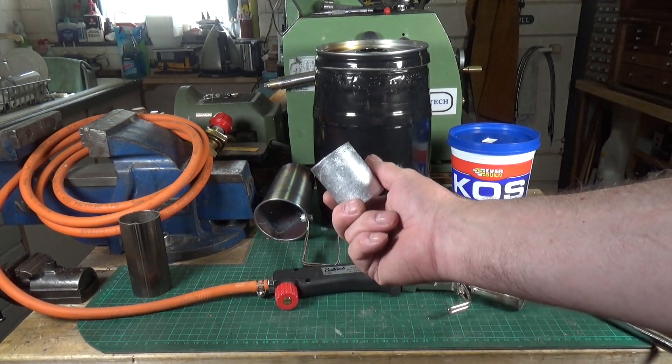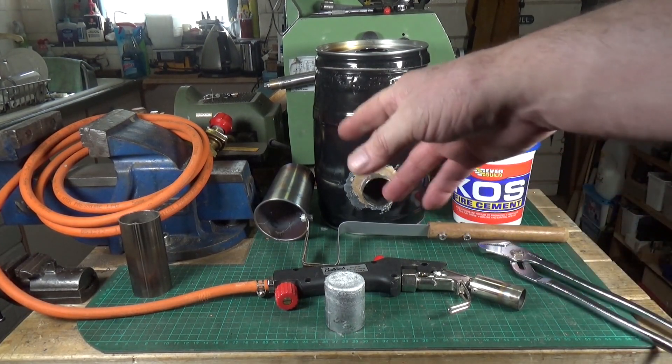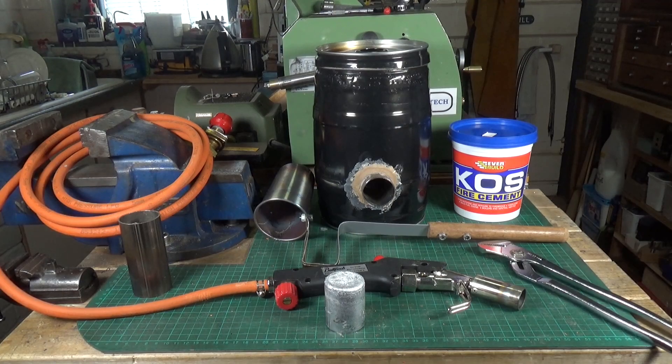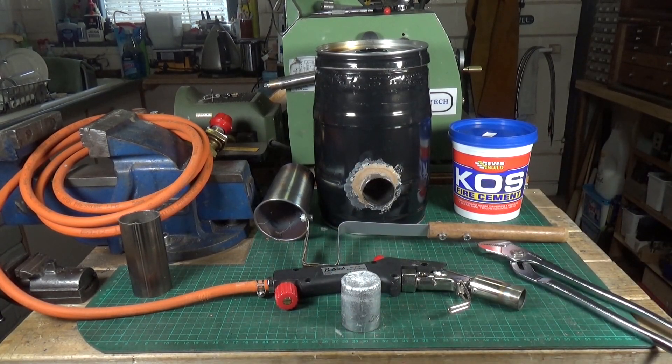Now I've got the ability to cast aluminium, so I need to go and find some good quality alloy. I'll put links in the description to the cup, the fire cement, and the torch. Providing you take proper safety precautions with PPE, this is very, very easy to do. The beauty of it is I'll now be able to cast aluminium flywheels — that's the biggest bonus from my perspective — and also make up my own aluminium bar stock, just like Rob does.